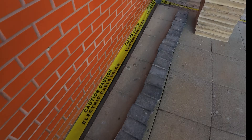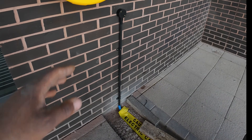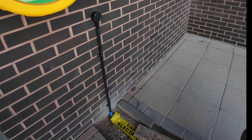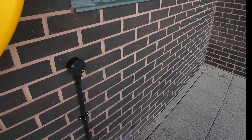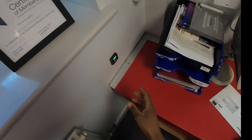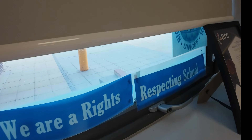It runs all the way around here, down here, and then we've got a bit of conduit that comes up in the office and drilled through there. Directly behind there is the exit button. We've jointed the cable - the alarm cable I showed you earlier - with push fits and ferruled it all off. This is the exit button we've put in - it's lit up with a green LED, this is a Paxton push button bespoke for their systems. When I press this the gate should swing open - there's a little flash to say it's opening - and yeah, that's open. All done - who said sparkies don't clean up? Spotless.